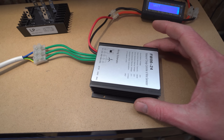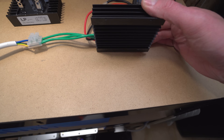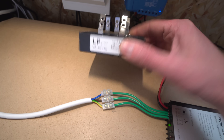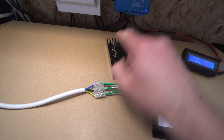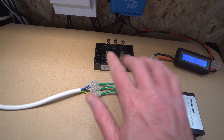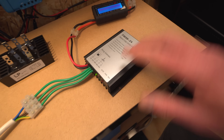The cable comes in and goes into a little junction box, then into the charger that came with the turbine. I've been doing a lot of reading about this — these aren't bad but they haven't got very big diodes inside, so I expect it might fail. I've invested in one of these bigger bridge rectifiers. The idea is your three phases go in, it rectifies the AC and comes out as DC — perfect for what I want. The charger comes with a kit and I wanted to test how well it worked, since it also has cutoff and charge regulation features.